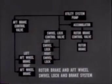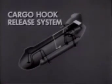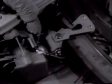The third hydraulic circuit goes to the aft brake control valve and then to the left and right aft wheel brakes. The aft brakes are parking brakes. They are not maneuvering brakes and do not function when the pedals are depressed. The Chinook's forward wheel brake system does not differ from the maneuvering brakes on other aircraft. The pedals are operated conventionally and operate the front wheel brakes. The hydraulic hoist system circuit includes a hydraulic motor to drive the winch and a hoist control valve to control its speed and direction. A simple circuit also operates the cargo hook release system. The hydraulic hook release valve is normally operated electrically by the pilot, co-pilot, or crew chief. In the event of malfunction, the hook can be released manually by the crew chief or from the cockpit by blowing it open with compressed air stored in a chamber inside the hook.